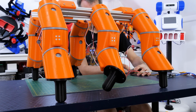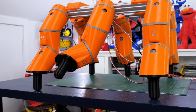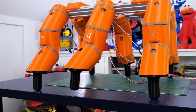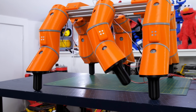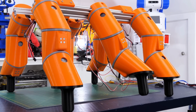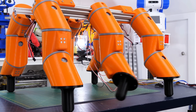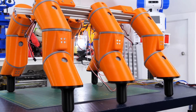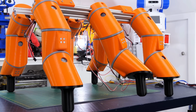to make a convincing motion. So first go at a bit of a sequence to try and lift up the foot and move it, which it does quite convincingly, although it makes quite big motions, so with the other feet taking steps as well, they're probably going to hit each other. So I've just sped that up a bit and also reduced the motion. So now we've got something where the foot tips back as it moves forward, and then it hits the ground again as the foot moves backwards to push the robot forwards. So pretty happy with how that looks so far.